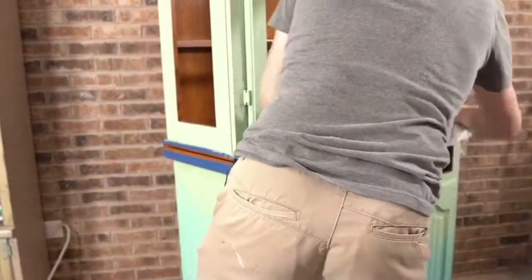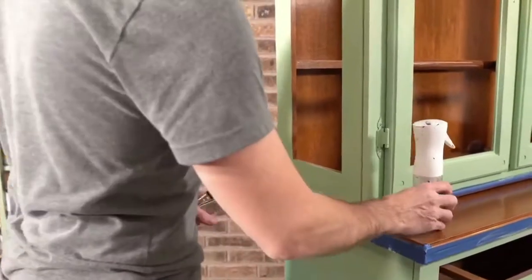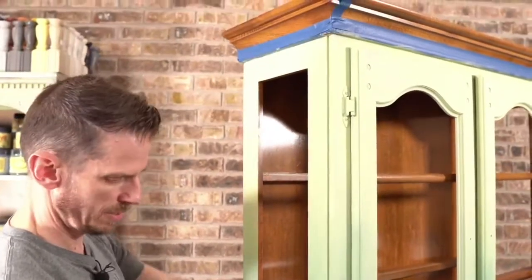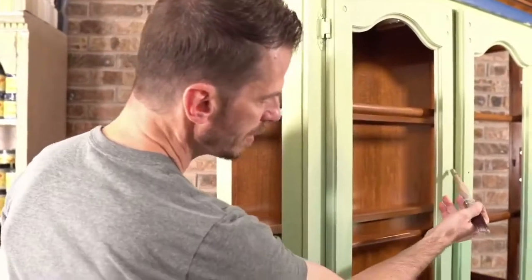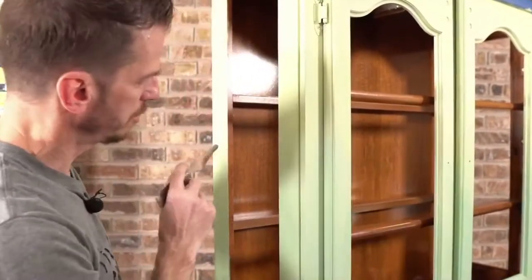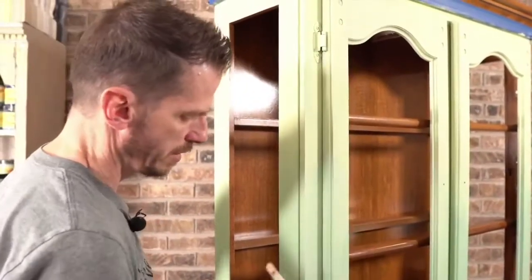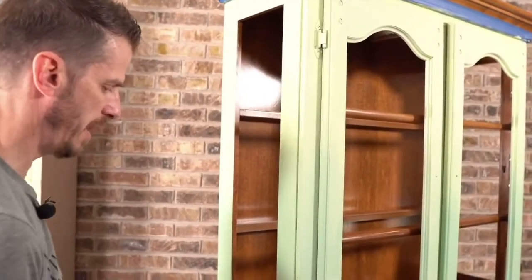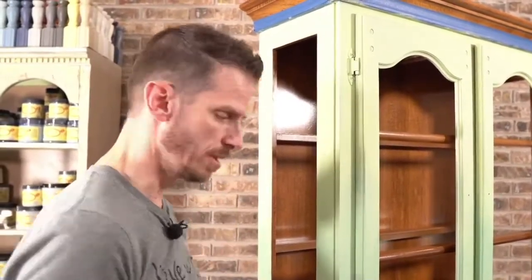I appreciate you coming in. I'm going to get my two brushes — two flat smalls — and I've got a wet brush I'll keep handy and a misting bottle. So here's the task: we're doing a one-color blend from the top of this cabinet to the bottom. I used the hardware holes as my center point, so somewhere in here is where we're going to blend. I did not tape anything off. I cleaned with White Lightning and also bossed this with Gray Boss at least a day ago, so it has plenty of time to cure.